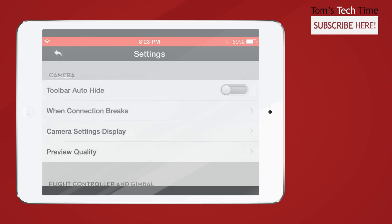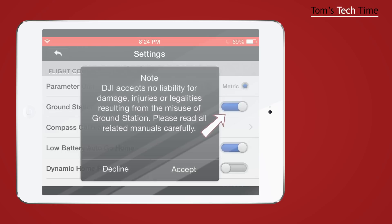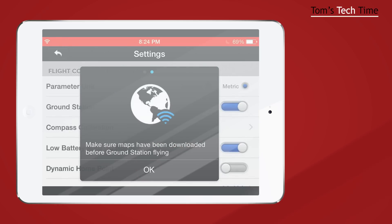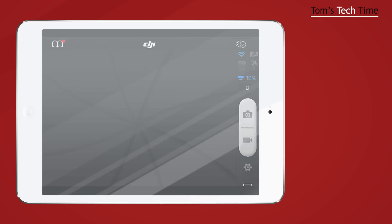The very first thing is you click Settings and scroll down until you reach Flight Controller and Gimbal, then the submenu Ground Station — and you'll see that it's not activated. Click that to activate it. DJI then tells you that if you fly into something, you pay the bills yourself. We say yes, accept the tips and hints, and note the important hint: make sure maps have been downloaded before Ground Station flying.